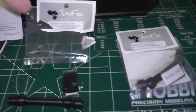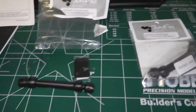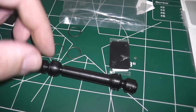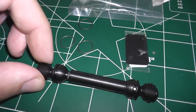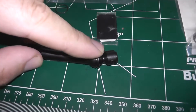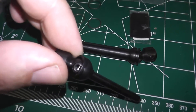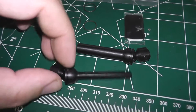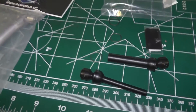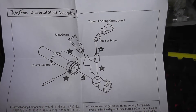Here's one out of the package. They wrap them up and staple them, and it turns out they're heat-shrunk across too. We've got these rings which are retainers for those pins right there. You've got to take the shaft apart, put them inside, and then once you're done greasing, you move these snap rings into place on top.